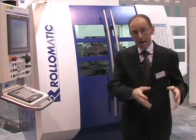But we can put in longer flutes or longer drills if necessary. The market that we've seen in the past has focused on gun drills, but it is slowly transgressing into spiral fluting drills — two-fluted spiral drills — so that long and deep holes can be machined on the same machining center that will do the milling and the deep hole drilling.